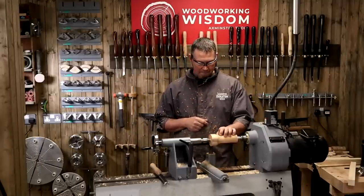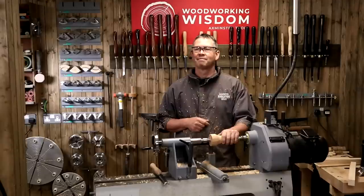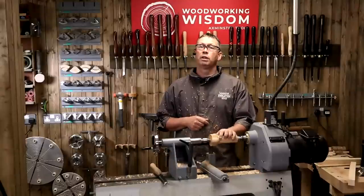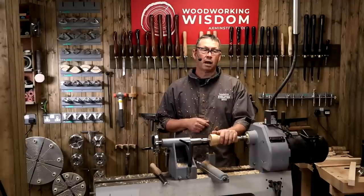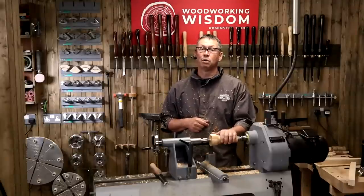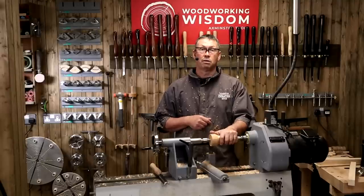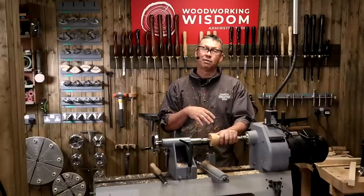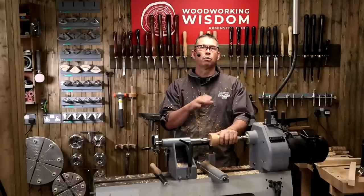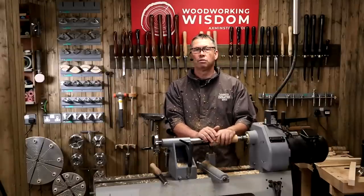Yes, Matt? I got another question from Frederick. I have just acquired a beech bowl blank, which has had woodworm. Is it safe to turn health-wise? Certainly safe to turn health-wise. Whether you want it in the workshop is another matter. If it's small enough to go in the microwave, give it a blitz in the microwave for 20 seconds, 30 seconds. That'll be enough to kill the woodworm. If it isn't, then you can treat it. But I would start by turning it to shape, seeing what you've got left, seeing if you can turn out some of the woodworm, or all of the woodworm would be even better. And it's a case of keeping an eye on it, to be honest.